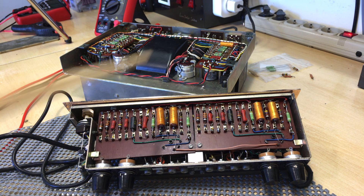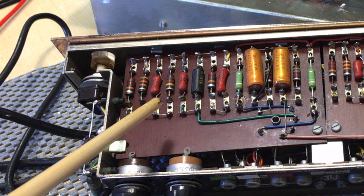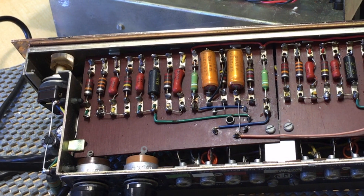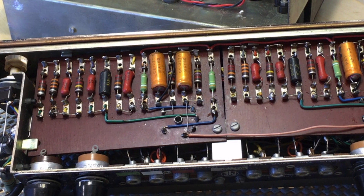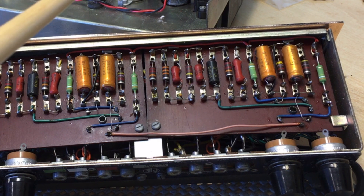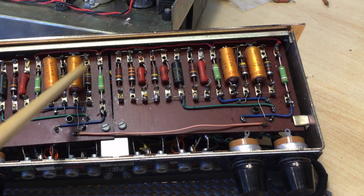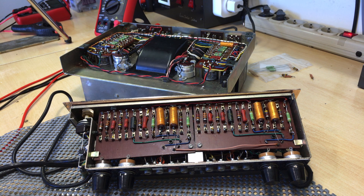It looks like I'm going to have to do the same thing here that I did over there. Fortunately this is on a tag board, so it's very easy to get to and do a nice clean job, which you can then clean up with isopropyl alcohol at the end. I'm going to try to keep this as original as possible. I'm not sure about restuffing the capacitors like I did on the other one — those were 1 microfarad, but these I believe are 50 microfarads and I don't think they'll fit.